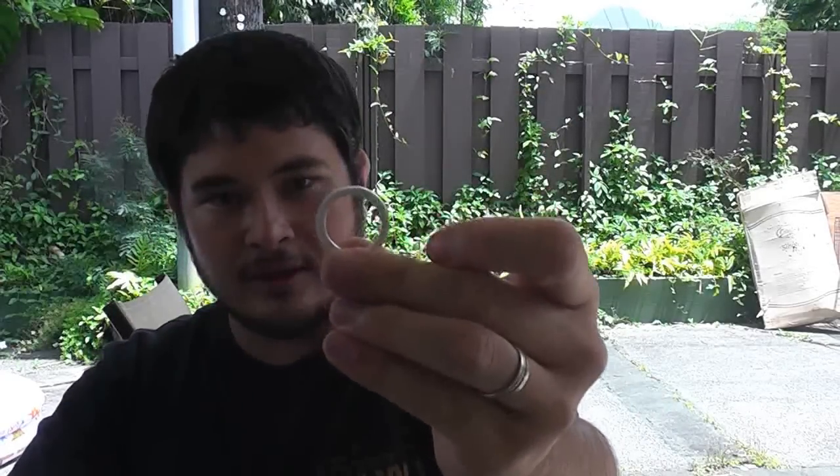This pipe — the Schedule 40 — is good. I use it a lot for the different bows. This SDR pipe is actually better suited for other things. If you did buy it, I wouldn't make any bows with it, but it makes very good flutes. The SDR-21 pipes make really good flutes just because of the wall thickness — it resonates a lot better than Schedule 40. So that's what I would use them for. Otherwise, I'd stick to Schedule 40. It's a good all-around pipe and it's so readily available.